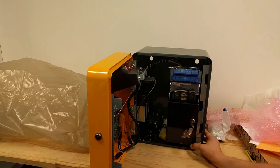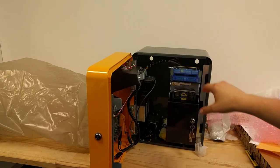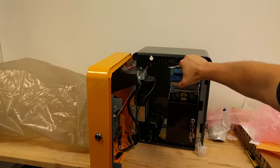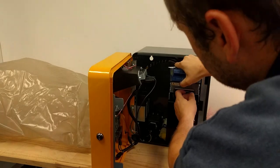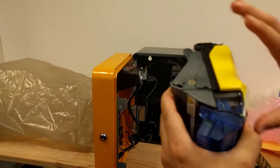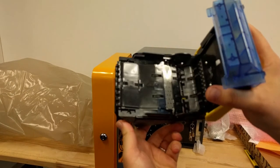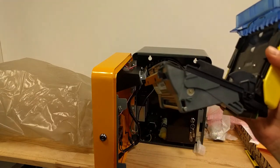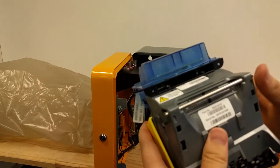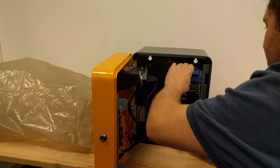Since I have the machine open, I can demonstrate that if you want in the future to take out the head and clean it, use a textile — don't use window cleaner or anything like that. You can take out this head like this. This is how you open it. You can clean it with textile, but maybe once a year or once every two years. These things work without actual cleaning inside; if you don't have problems reading banknotes, you don't have to clean it.